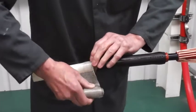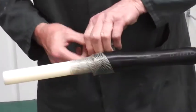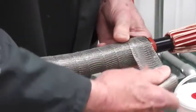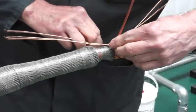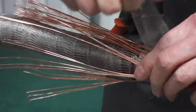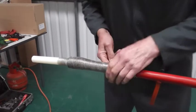Now take the copper screening bandage, tightly wind it over the complete pot end starting at the insulation rod with 50% overlap. Take it right up to the copper screen wires. Now bend back the screen wires upon the core. Apply more mesh so that there's really good contact between the two, and keep applying the mesh right over the pot end and secure.